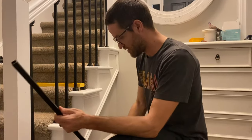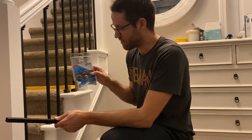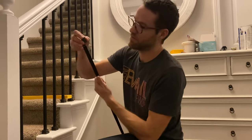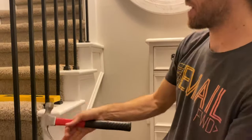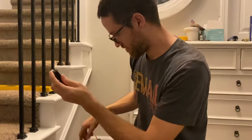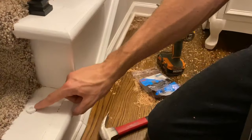I've obviously done the majority of this, but I saved one to show you how to do it. What we're using are products from Home Depot — there are tap-and-twist parts for balusters. The bottom plug goes in once you cut these to size. You have to measure them — it's pretty easy — cut them to size with a normal jigsaw with a metal cutting blade. Then this tap-and-twist kit sets into the hole where the old baluster was.